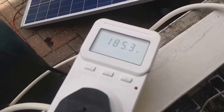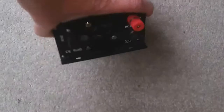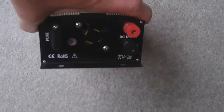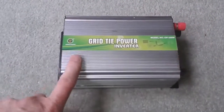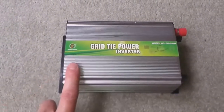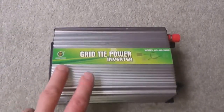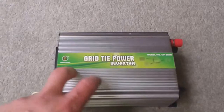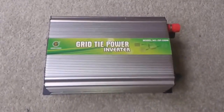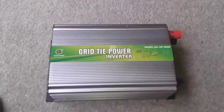If you are going to buy one, firstly this model is actually very good, and secondly I would go for the 28 to 52-volt one because high voltage means less amps. The amps seem to peak around 8 to 9 amps, and 9 amps at 24 volts will give you more power than 9 amps at 12 volts. So if you are going to get one, I would go for the high-voltage version, but other than that I'm very happy — very good inverters.